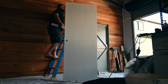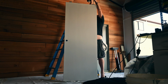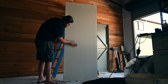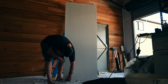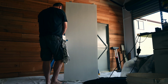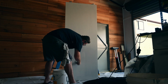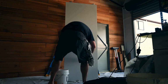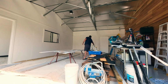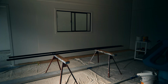You may have noticed that I removed the door, and that was to make it easier to paint. In another life, I learned to stand the door up on some scrap pieces of timber and brace it against something to keep it upright. This works better with multiple doors, but in this case I've used a ladder, a clamp and some scrap timber to support the door. It was then given a coat of the wall paint, as an undercoat for its final gloss coat. Then it was time to crack open the black paint and go to town.